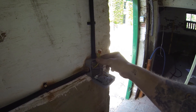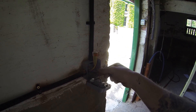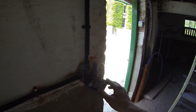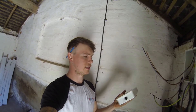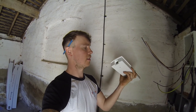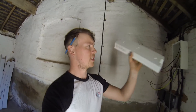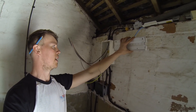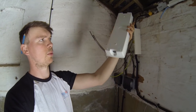Switch is wired in now - linked out the earth in and out, and also in the back box for good practice. Neutrals: feed in, feed out, and then your common and switch cable go into the back. I'm nearly ready to connect up, cables are all in. One thing I've started doing recently - on any fuse board with excessive space around it, I've started fitting an emergency light. They're not expensive at all, I think it was about 15 quid. I've got a hole in the side, drill up there, and I've wired the feed straight from the board. The first point on the circuit will be the emergency light fitting.